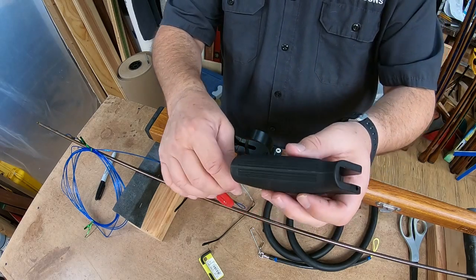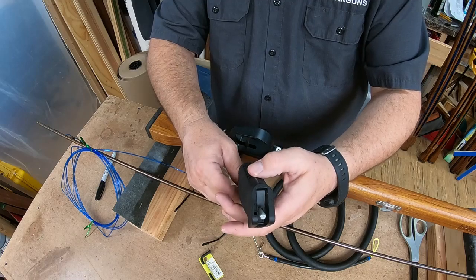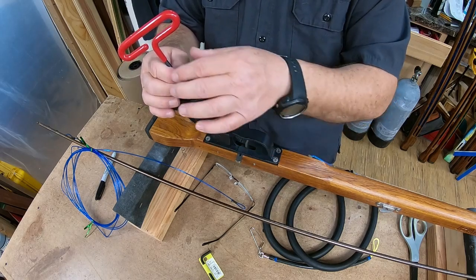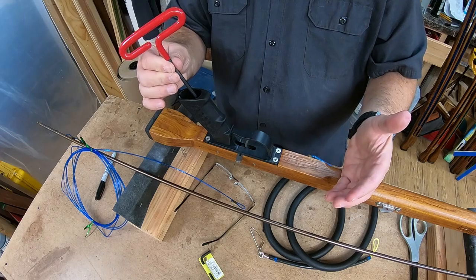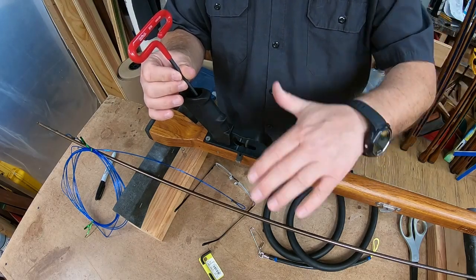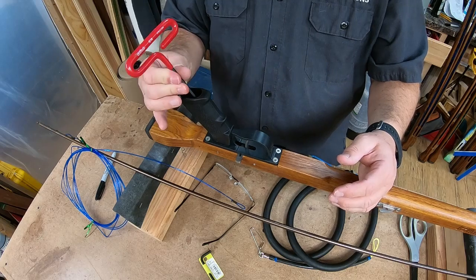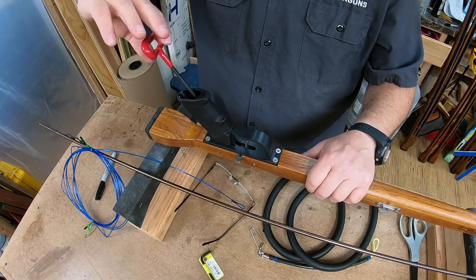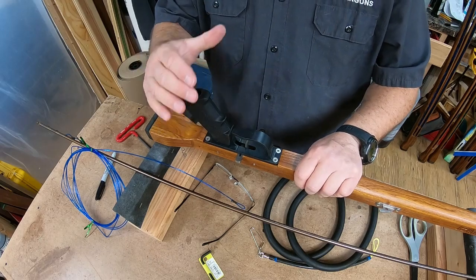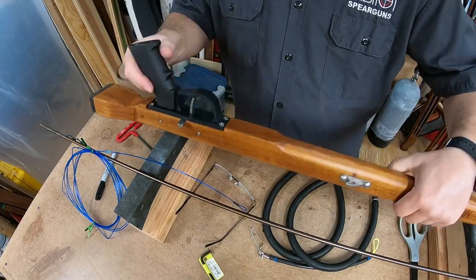I simply put the bolt on there and get it inside. Now, what I'll do is spin it in the opposite direction — so instead of going righty tighty, we'll go lefty loosey — because what I want to feel is the thread drop. As soon as I feel it drop, I know I've hit the very first thread, so now I can begin to turn it and it should thread properly. Once it gets to the point where it's snug, just give it a little bit of extra. You don't want to over torque it — just snug. There's a little split washer in there; you just want that washer to flatten out and it'll hold just fine. Handle's good and tight, it's not going to move. That's step one.